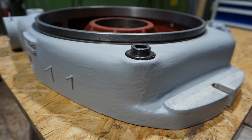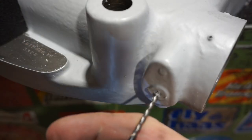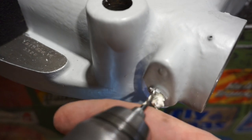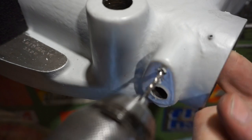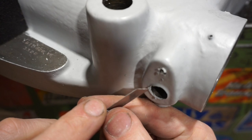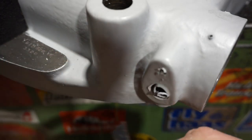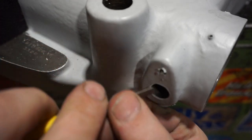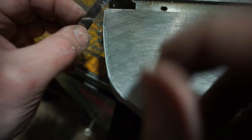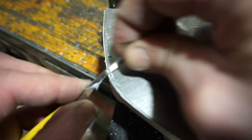That's the surface after applying three wet-on-wet brushed-on layers of fill primer. Here I'm demasking areas we couldn't properly sand — such as the holes with plugs. An important part of this step is to chamfer back the filler at the edges where it meets functional surfaces — I'll talk about the importance of that later. I'm chamfering using the knife for scraping; it would be more elegant to use the scraper but sometimes laziness has the upper hand.